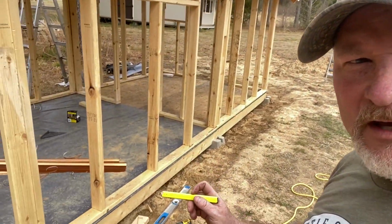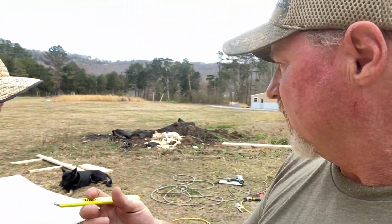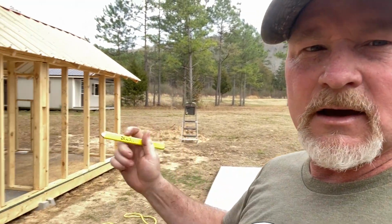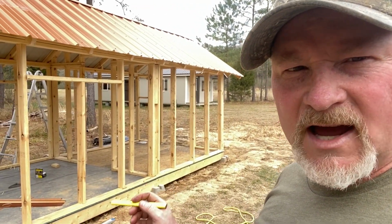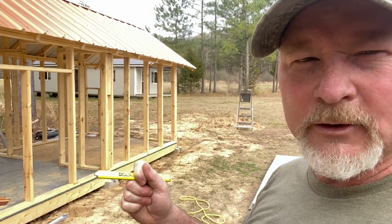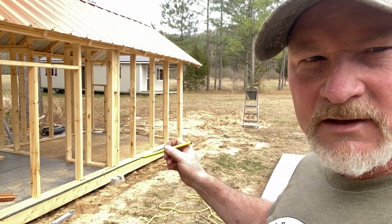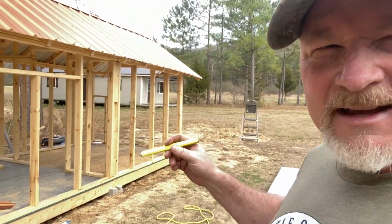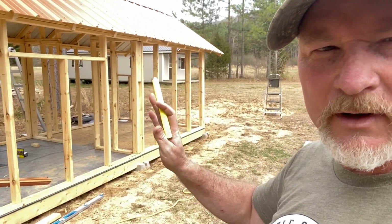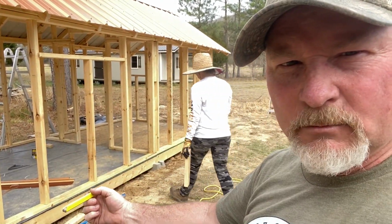But it's imperative to get it down here to link it to this bottom down here, because you're basically bringing the framing up here on the top and the banding down here on the bottom together. You're gluing them together even more so than just the nails that are on top of each of these 2x4s. That adds a little bit of gripping power, but it doesn't add tension strength or shear strength. So when we put that siding up, we're going to tie it to the bottom down there.